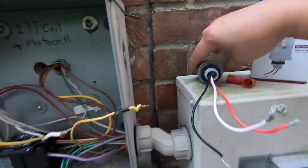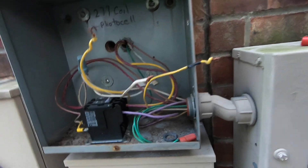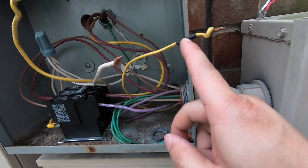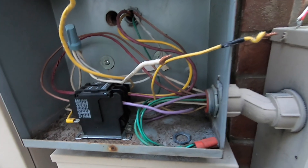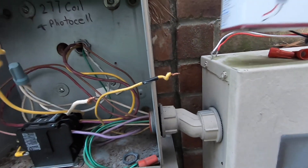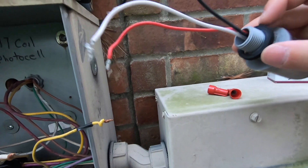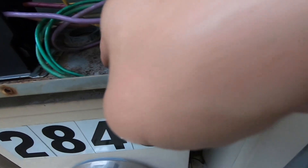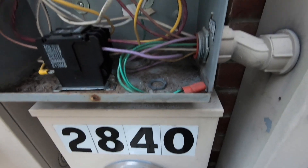I just got the old photo control removed. These are the three cables — I marked with black tape where the black cable goes, where the white goes, and where the red goes. Now I just need to unbox the new unit and put it in. Make sure you place the rubber seal so water doesn't get in, and we're reusing the ring washer at the back to make sure it's tight.